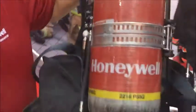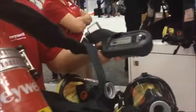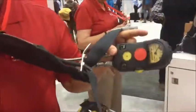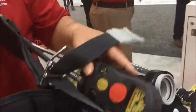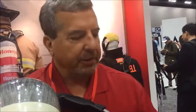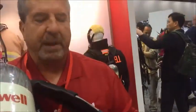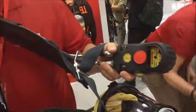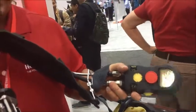We have two PASS motion sensors built into the unit. One is at the base of the unit, and the other one is located in the PASS device itself. These two motion sensors work in tandem — they're redundant sensors, so anytime either one of those sensors are in motion, this will keep the PASS device from going into pre-alarm condition. This is the largest robber of the battery power, having a PASS device go into a full alarm, which robs a lot of the battery power.